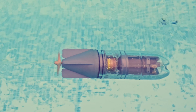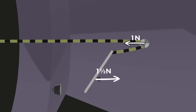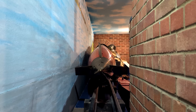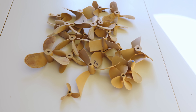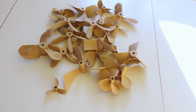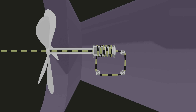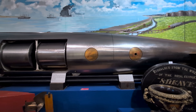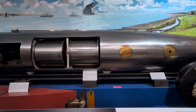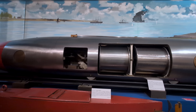It's not so easy to see where the mechanical advantage is with an actual propeller because fluid dynamics is complicated — variables like blade angle, size, and spacing all matter. But one straightforward thing: you can increase mechanical advantage by increasing the size of the drum the cable wraps around. On the Brennan torpedo at the Royal Engineers Museum, a panel has been cut away so you can see those spools — and they're almost as wide as the torpedo itself.